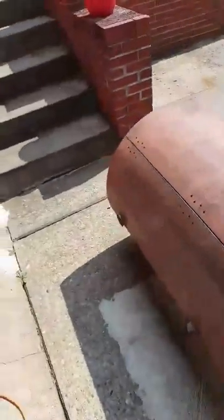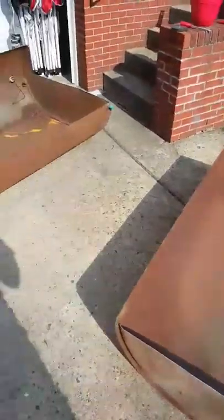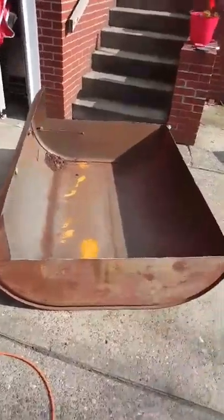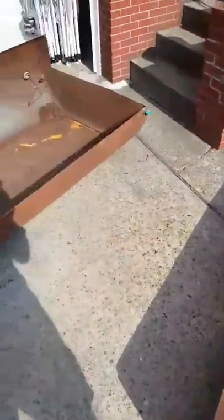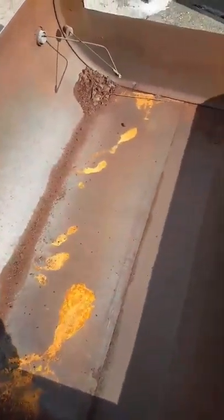All right, well, I decided to go ahead and cut rest it off like I had mentioned to you. Got the cut here, hinged off. What we got to do next is go ahead and sweep out the inside again, and then go ahead and burn it out. Get any residue that may be left in there. Looks pretty darn clean because it's an old tank.